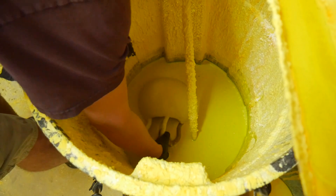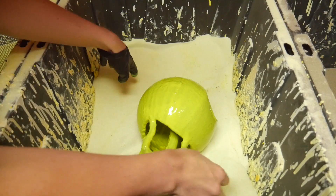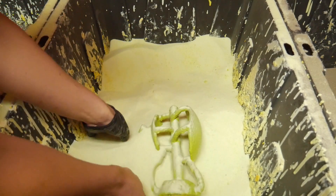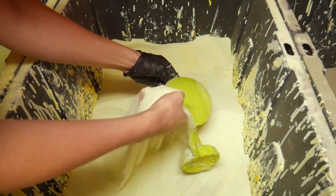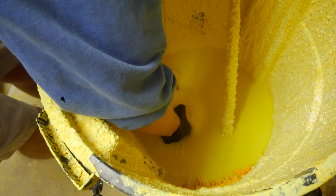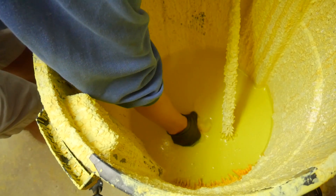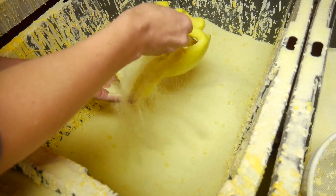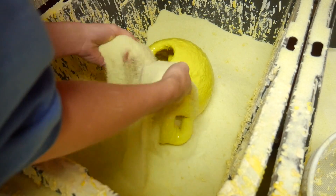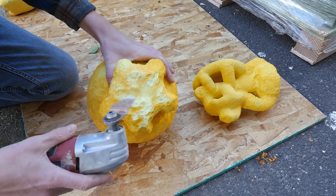Really the only area recognizable as anything other than a sphere is the balloon knot, and this should be plenty to capture that part of the sculpture. This is the first major increase in grit or mesh layers — the beginning of just being concerned with thickening up the outer shell. This speeds up the process but will also fill medium-sized voids or spaces in the wax to prevent bronze from entering unwanted areas during casting. This is the coarse grit phase, which is the final step to create strength and structure in the shell for when you pour the bronze into the void, preventing it from exploding out, leaking, or spraying molten metal everywhere.